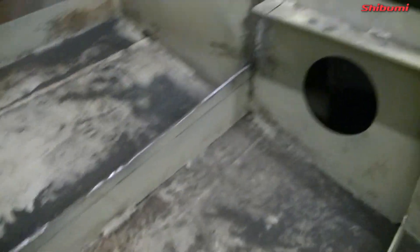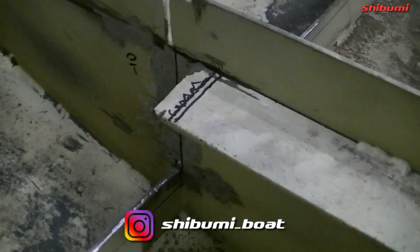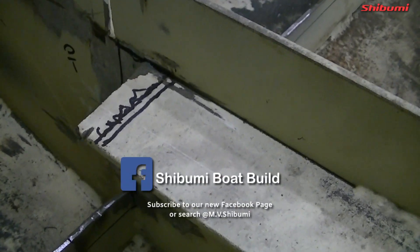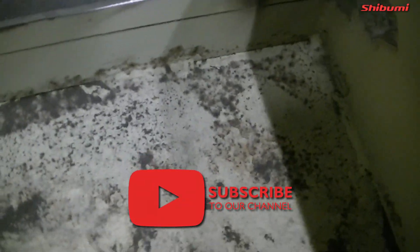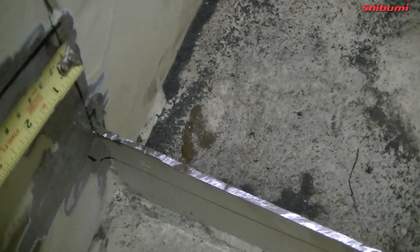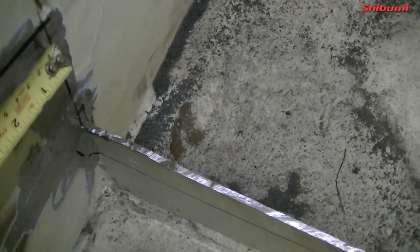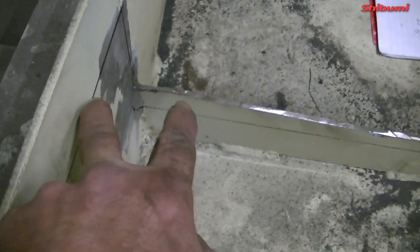I've leveled out and ground back everything that was welded onto those surfaces. The black line there is going to be cut, and that bottom piece is going to be welded solidly to the floor the whole way around. Then I want to bring in a piece up to there, and it's going to need a small piece of 40 by 40 angle iron to meet it, and then another piece of 50 by 5 sitting in just there coming across this line.